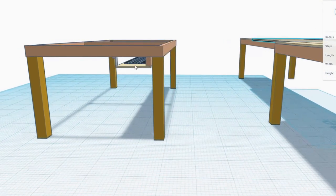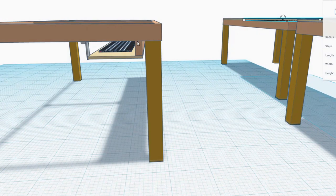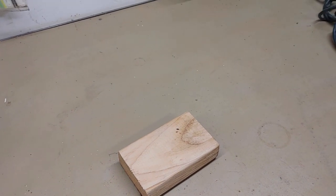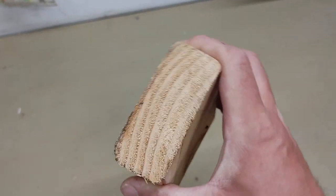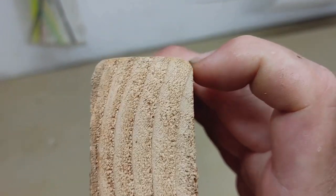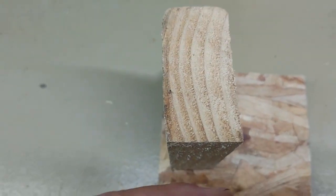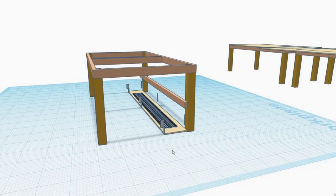One side of the tunnel is supported with a two-by-four that runs the full length of the table. This two-by-four has been ripped down from three and a half inches to three inches. Not only was three inches the amount of drop we needed, but dimensional lumber has radii on the corners which slightly reduces the mating area when connecting to another piece, and there may also be a slight curvature on the face. After ripping it down, that edge is now super square and we have maximum surface area where the shelf or support will be attached.